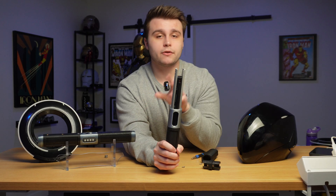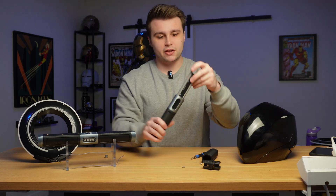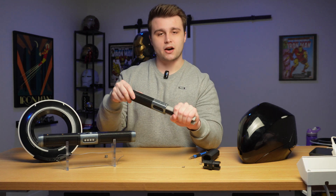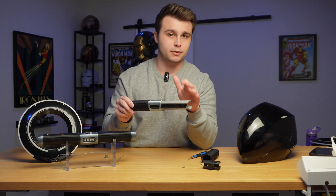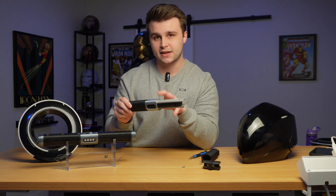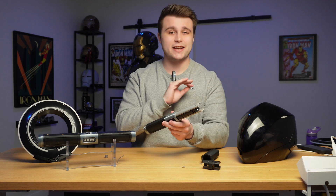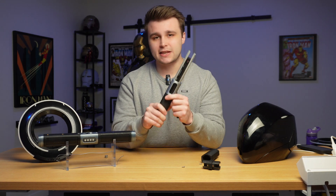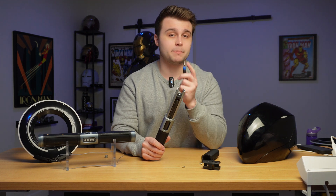On this light baton, the rails are 3D printed out of PLA, and that's more than enough because those rails are actually 3D printed flat on the bed with supports. That means that when the light baton flexes on either side, it's not going to split along the layer lines because the layer lines are actually perpendicular to the light baton itself. That was the first version of the light baton I ever built — I've had it for quite a few months now and I've had zero issues with it. When I rebuilt the second version, I wanted something even stronger, so I had it SLS printed out of aluminum by PCBWay.